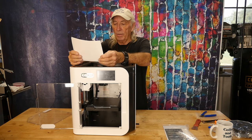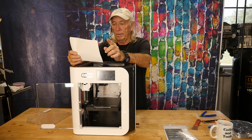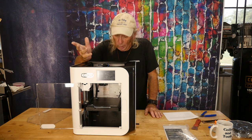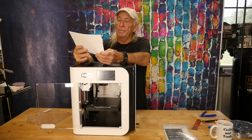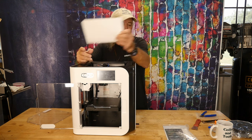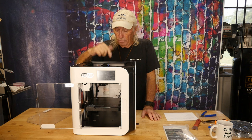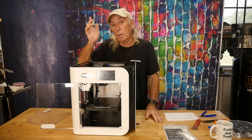The flow rate is at 30 cubic millimeters per second. The print size was the only thing that worried me a little bit — the bed size is 185 by 185, and the actual print volume is even less: 175 by 180 by 170. It's a pretty small bed size, but I checked my models and everything I manufacture right now will just fit on that bed size, so we can work with this.